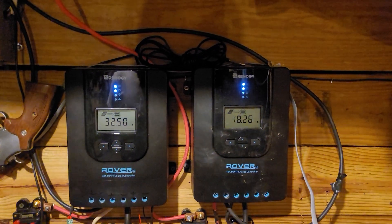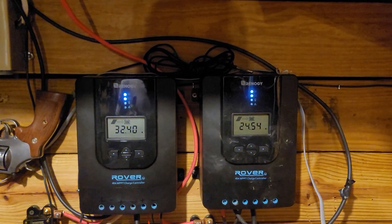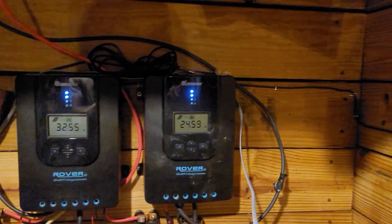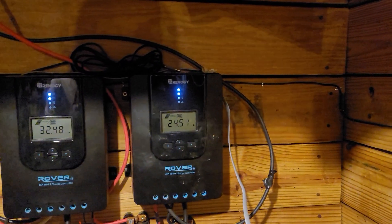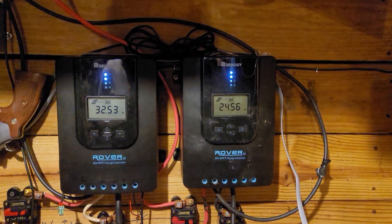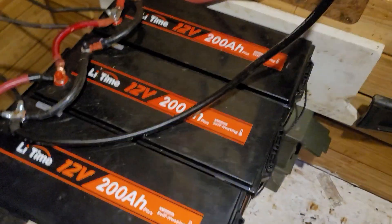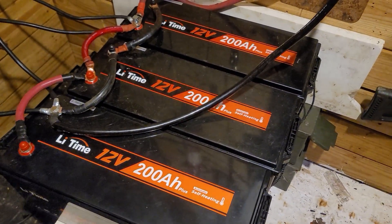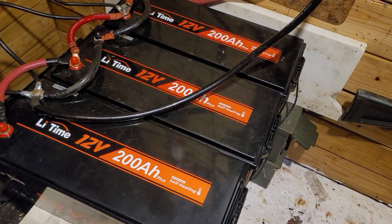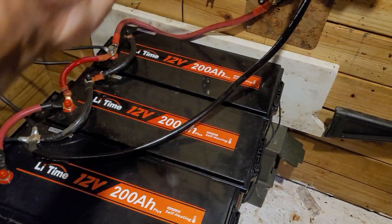I'm really, really enjoying this — this system is awesome. You saw that fluctuation there; that's just clouds passing and it straightened back out to 24. When clouds come across you'll see them jump a little bit. I am going to put a third charge controller in right there. I want enough to charge these batteries up in maybe four or five hours when I have a lot of sunlight, and enough storage capacity to run throughout the night. That's a lot of kilowatt hours in these 200 amp hour batteries. When you combine them in parallel you still have 12 volts, but your amp hours add up — so that's 600 amp hours at 12 volts.